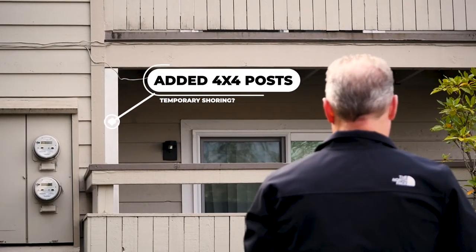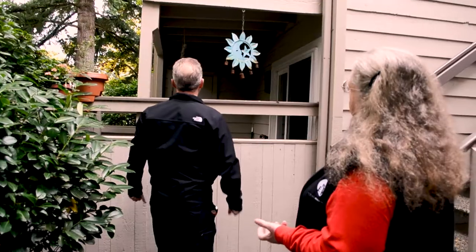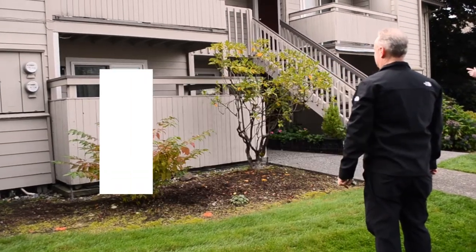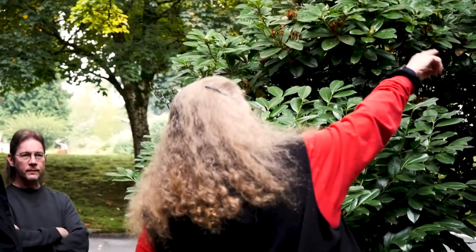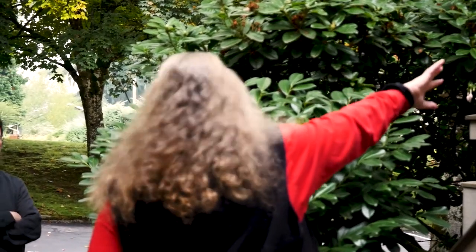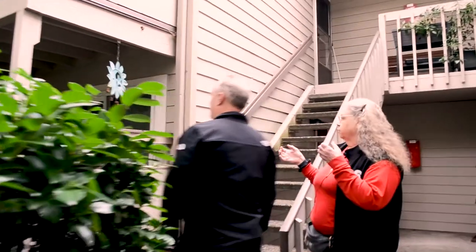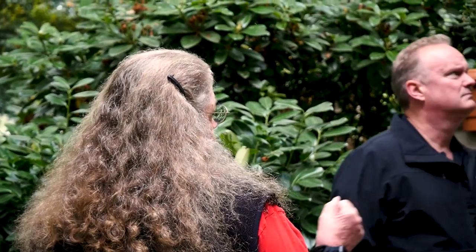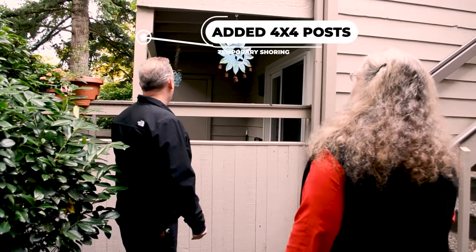There are lots of posts that make me a little nervous — the four-by-four posts. A couple years ago we noticed that these decks had a lot of deterioration on beams, and when we took one apart, to our shock and amazement, we discovered that what was supporting that end of the deck inside the storage closet was just a couple of stud-grade two-by-fours that had been getting wet over the years. You couldn't always tell externally how bad the problem was. So we think we've gotten the most rotted ones done, but out of an abundance of caution we call it posting them up — we stuck a four-by-four under there, painted it to match the building, and it lets us sleep at night.